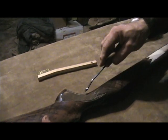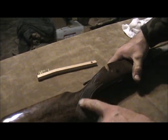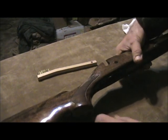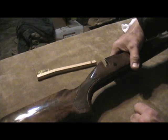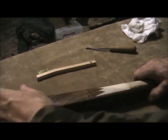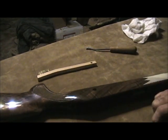Then I'll come back and hit the opposing lines, and after that I apply a coat of True Oil into the checkering — that gives it a nice even finish and you see the grain actually coming through the checkering just like it's supposed to. So I'm going to go ahead and finish out all four panels, take the tape off, get it all finished out, and then I'll come back and show you how to apply that True Oil to the checkering so that your gun stock is complete.